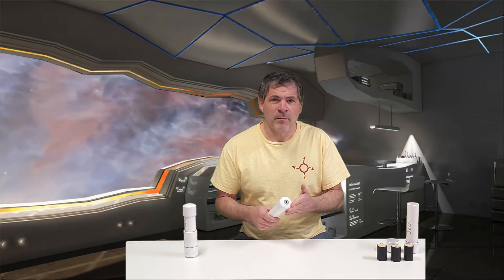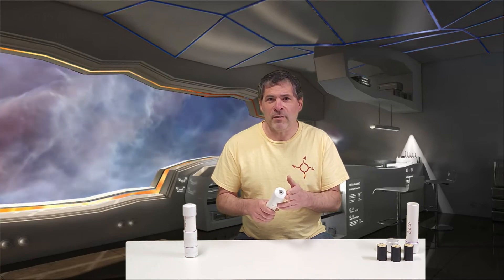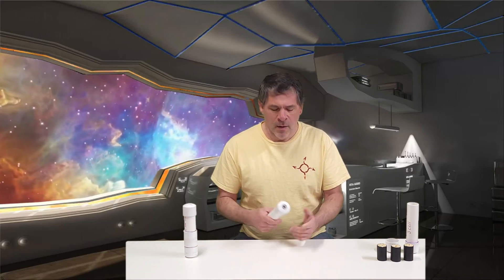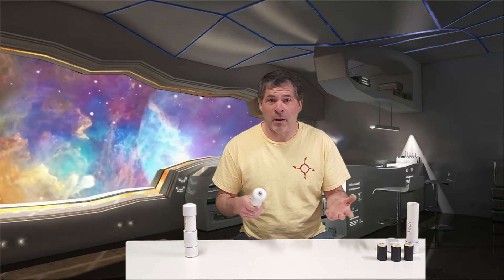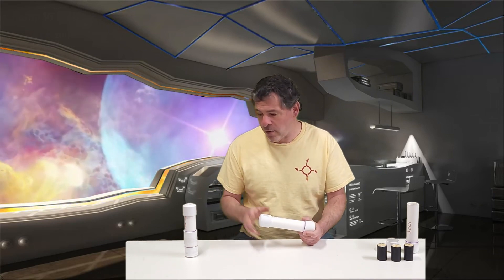I kept referring to it as a number 20 nozzle. Here in the United States, because we use the Imperial measurement system, nozzles are measured in 64ths of an inch. So a number 20 nozzle is 20/64ths, which is about 7.9 millimeters. In countries that use the metric system I'm guessing you'd refer to it as a 7, 8, or 9 millimeter nozzle, but here in the United States it's always in 64ths of an inch. We still have the number 20 nozzle for today's tests because that worked well.